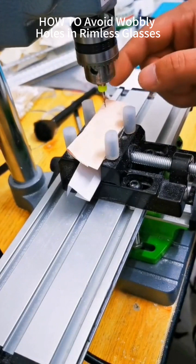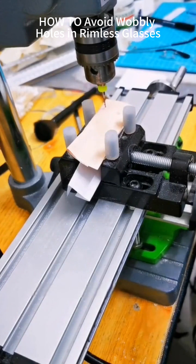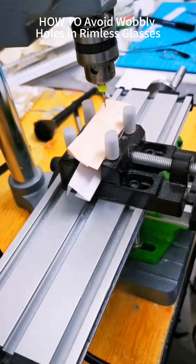Using 1.5mm drill bits creates 1.6 to 1.7mm holes — that's not precise. Many clients ask me after purchase: why does my drill make imprecise holes? When I check their drills, I tell them your equipment is inadequate. Insufficient rotation speed guarantees failure. Makes sense?